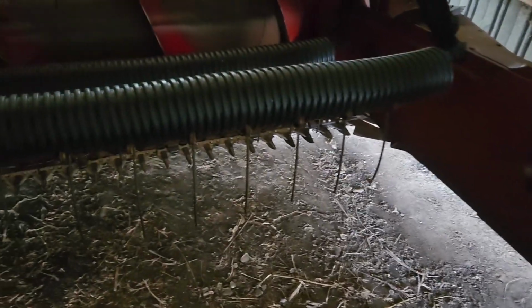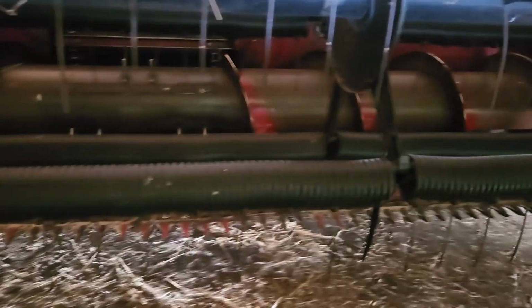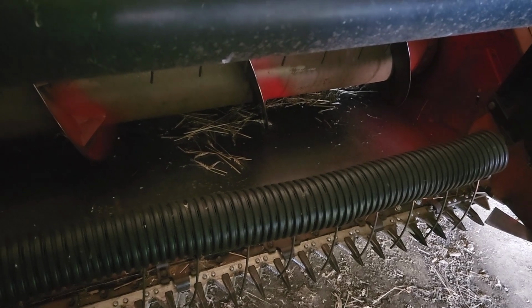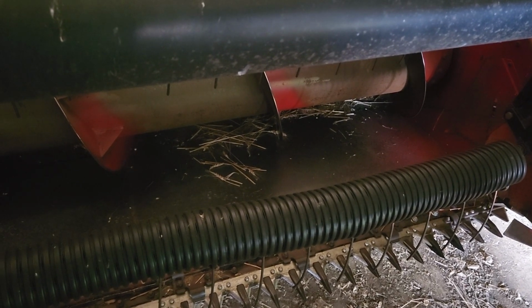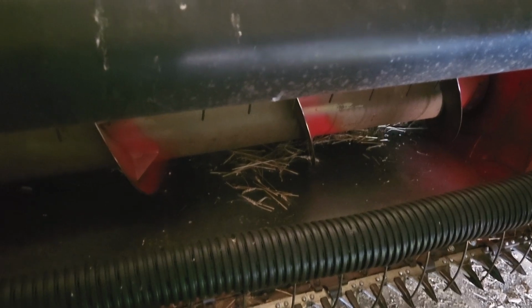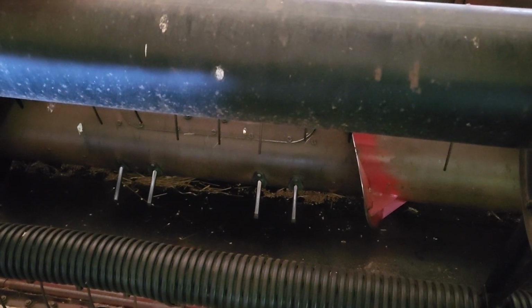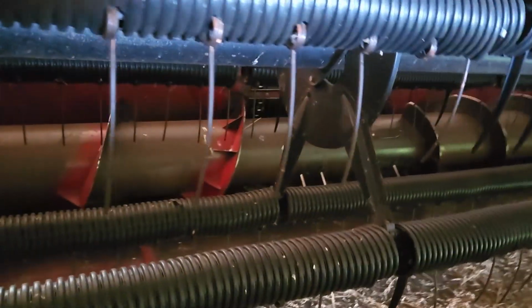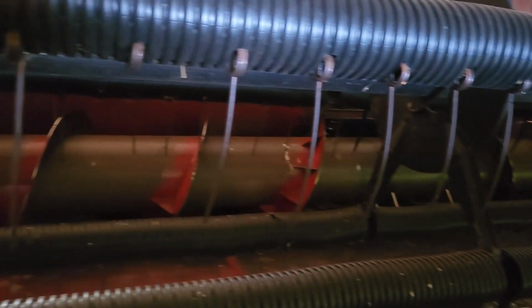I think it'll rake them in. Hopefully, I don't know if it's going to help out or not. We won't know until we get into them because I don't know what the cause is, but you get into super short beans, and then the beans will cut off, and then they just lay over on the table, and they just build up, and then all of a sudden they just come as a big bunch once the auger gets a hold of them, and they come to the center and plug it up. And this machine doesn't have a reverser yet. This engineer's working on a way of doing that a little bit different than what you've seen in the past, so I don't know if it'll work yet, but if it does, it should be a lot easier setup than what some other folks have.